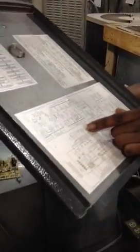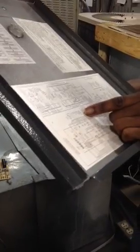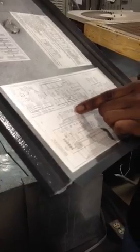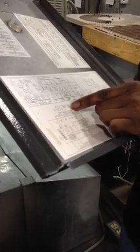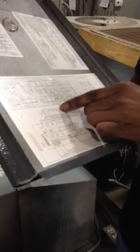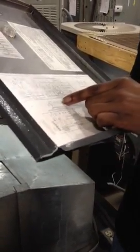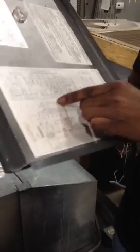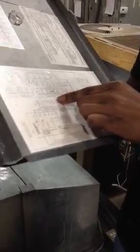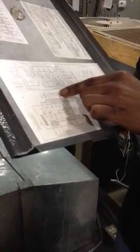Here's your blower motor on the schematic — I'll trace those wires to see where they're going. The white wire of course goes to your neutral. The red wire is your low speed and it goes to the park terminal, so you're not using the red wire. The orange wire is medium-low and goes to low heat. The black wire is your high cool, and the blue wire is your medium speed going to high heat.